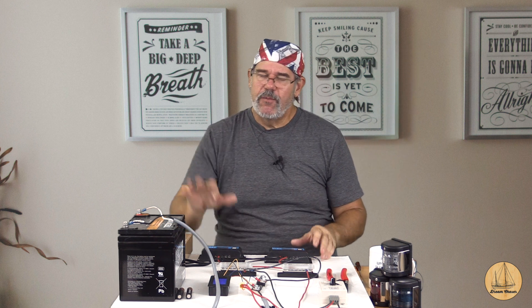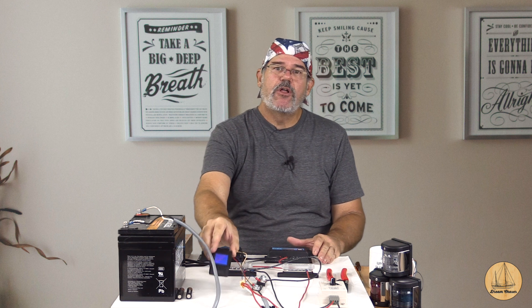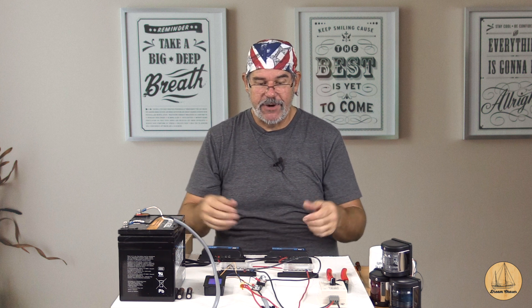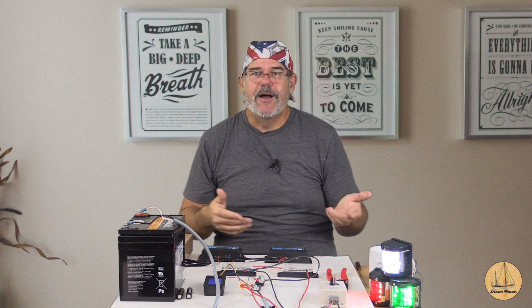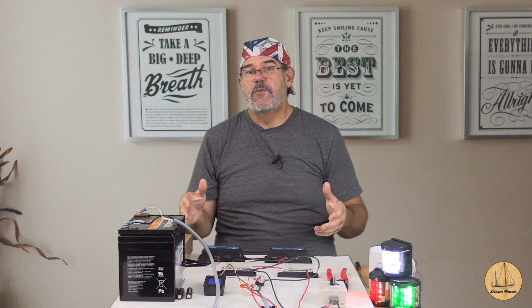In that video we have a battery, two test solar panels just outside the frame, a small shunt and battery monitoring system — I bought a really cheap one that measured one way just so I could see the input coming in. We had two inexpensive charge controllers; I did all this on cheap China-built items just to do my test. The conclusion was you actually do get better amp output over the term of the day if you have multiple charge controllers.